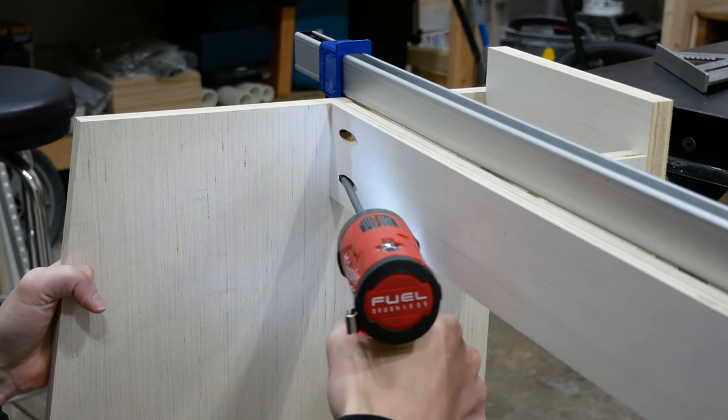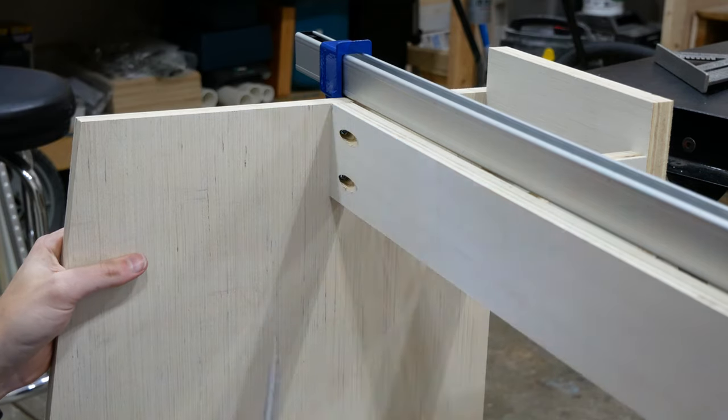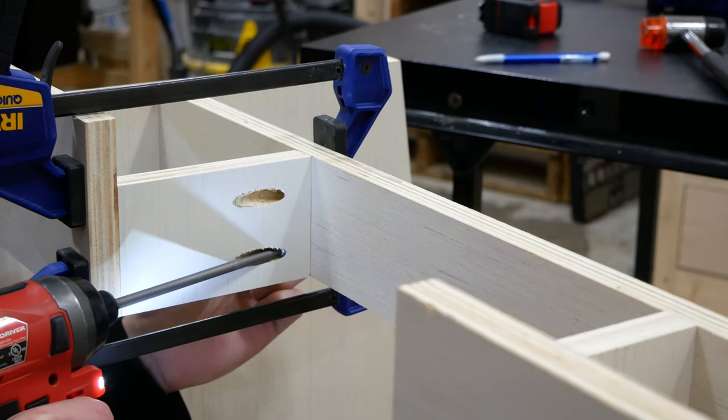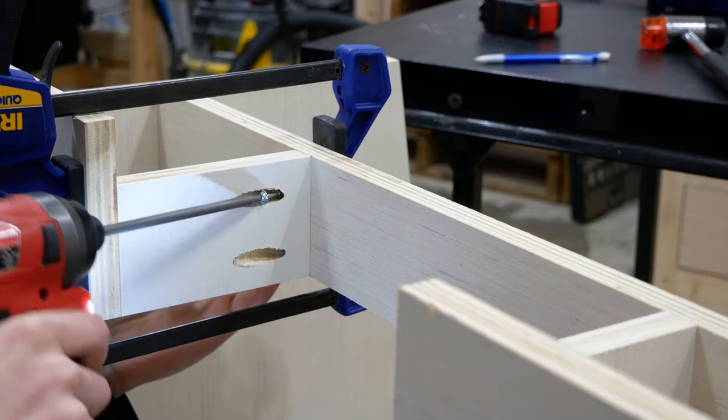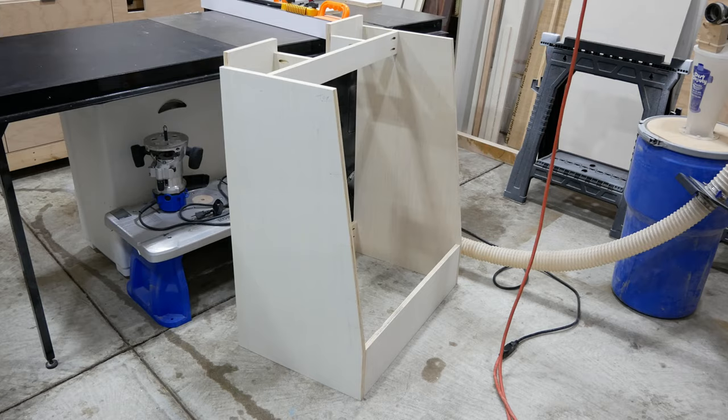I added a piece across the top of the box and screwed the smaller pieces to that cross piece to complete this duct-avoiding frame. Every situation is going to be different so just modify as needed — hopefully your ducting won't come right up against the wall and you can just put a cross piece directly at the back top edge of your cabinet.